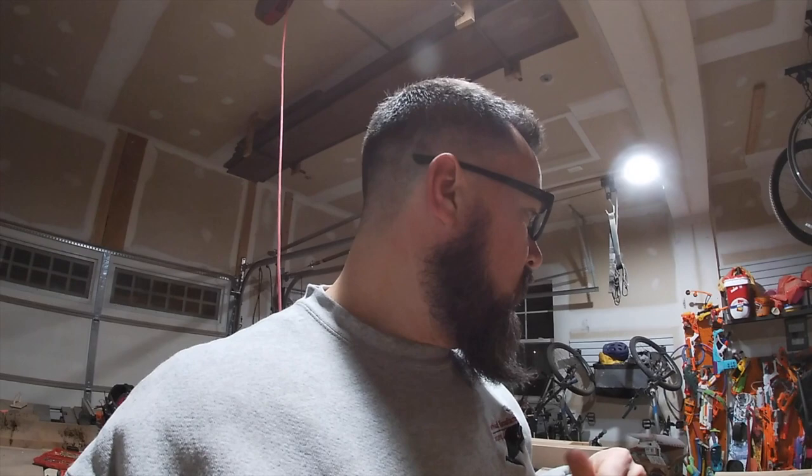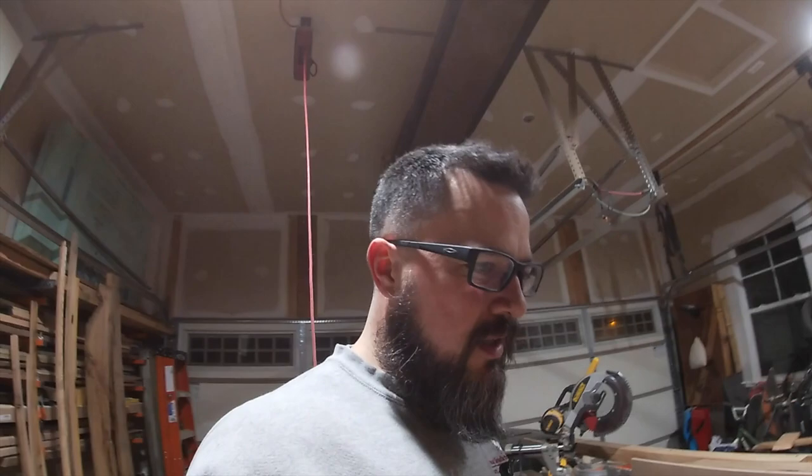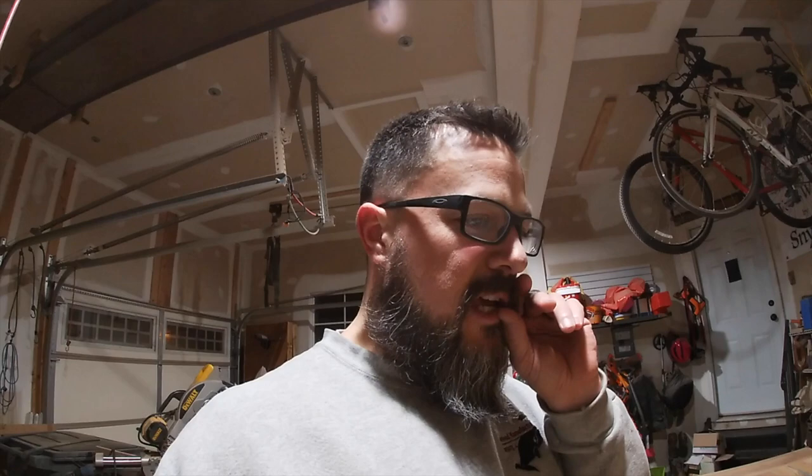So I don't know if you could tell, because I'm going to do a time lapse. But it's definitely with the 180 grit, that pencil trick really does work. Obviously, you got to take your time and let the sandpaper do the work, but it takes much longer with the 180 grit to get the pencil marks off, which is really the point of it. You're spending more time sanding, getting to a very good finish on the wood.